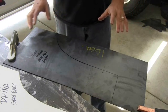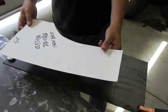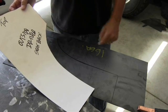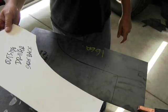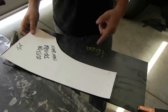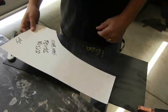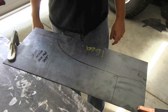I've repositioned the camera and I've gone ahead and made a template of what I need out of construction paper. You can buy this just about anywhere and it works out pretty well when you're doing sheet metal work. This is going to be the outside driver seat back. Once I cut this out of the construction paper, I simply laid it on my 16-gauge sheet metal and traced around it with the ever popular Sharpie — these things are awesome. This is what it looks like right now, and I'm going to start cutting on it here in a minute.